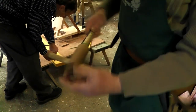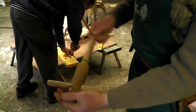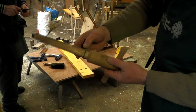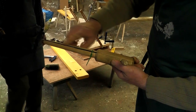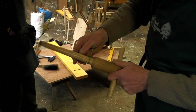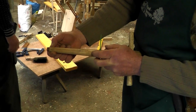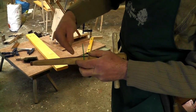into your tapered reamer. I turned this up on the pole lathe and the construction should be fairly evident from here. I found this flexi tie really important to keep the blade in the slot. It just needs to have a slight edge raised onto it, so Google scraper edges. Peter Follansbee suggests that this should taper at about 1 in 12. Do your maths carefully, otherwise you'll end up doing it 1 in 24 as I originally did. Remember that it's one side only that's 1 in 24.